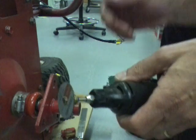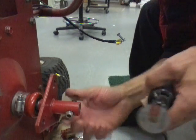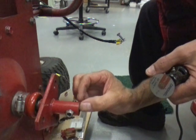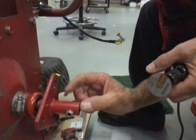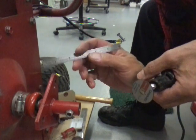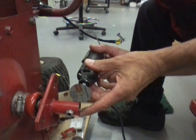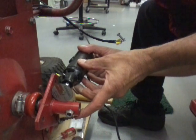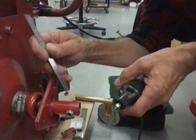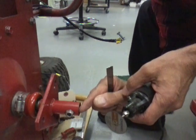What I did to get this thing off is I turned them so the bolt is horizontal. The thickness of this wall on this tubing is an eighth of an inch. I've got a scale - it's just a thin metal ruler that all us machinists use. As you're cutting, you want to cut right down the center of this tubing, 90 degrees to the bolt, and you can check the depth of cut with your scale so you're down at least an eighth of an inch.